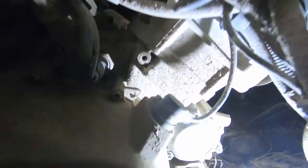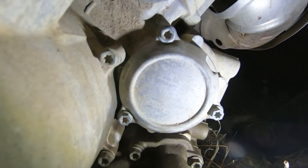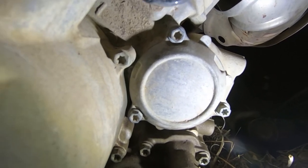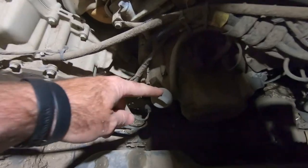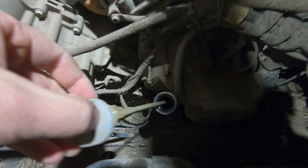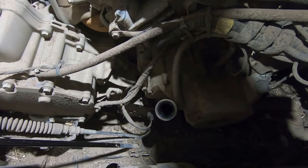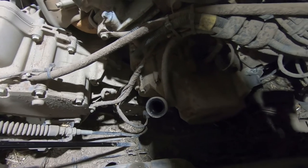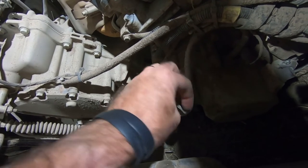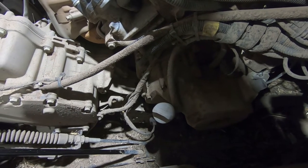Next we need to take the old oil filter out and put a new one in. There are three Torx bolts — undo those, and when you fit the new oil filter, remember to install the new O-ring as well. Then we'll be ready to top up the oil. This is your dipstick, which is also where we top the oil up. We pour both of the large bottles in and most of the small bottle as well. Then put it back in, get the machine up to operating temperature, keep checking the dipstick, and make sure you've got exactly the right amount of oil.